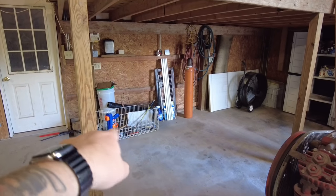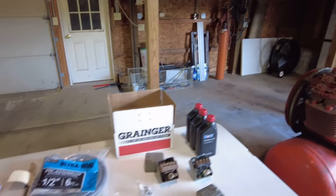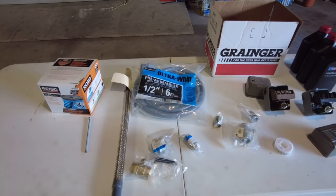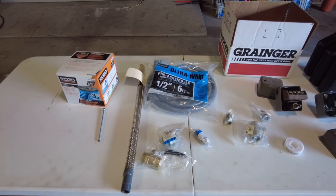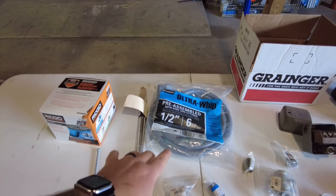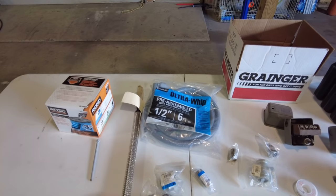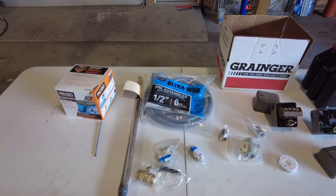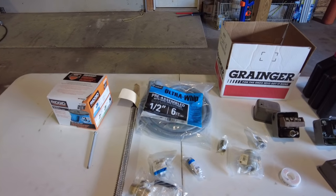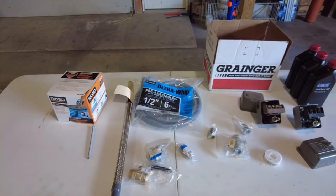Compressor's going to be sitting right here where this little basket thing is, after I get those few things moved out of the way. So that should work just fine. I looked at getting some 10-2, some conduit with the metal casing and everything, but this, for an air conditioner, which is what this is actually made for, hooking up air conditioners, this was like $15, and the other stuff for a like 15-foot thing of 10-2 was like $42. That was ridiculous.